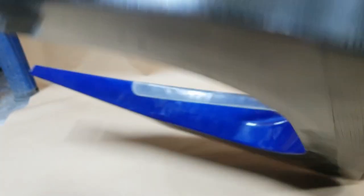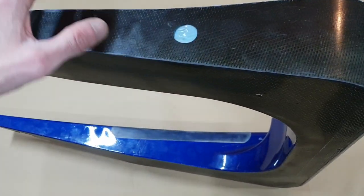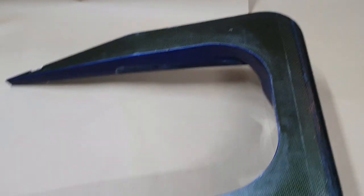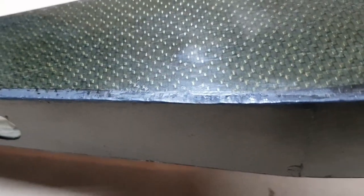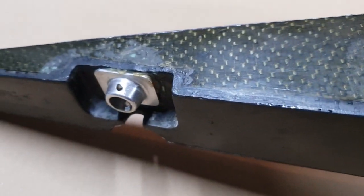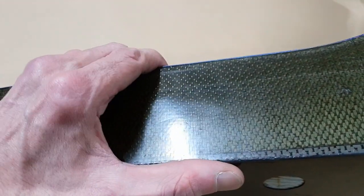Now if we flip it over, so this will all be made in one mold here, the top part, simple enough mold, and it's turned over. Then the part is taken out, the thin carbon fiber part is turned over, the foam is inserted, and the underside then is bonded in. You can see the bond line hopefully there. So that would be a post bond after it comes out of the autoclave. So again, the bottom, you can see it's really thin.